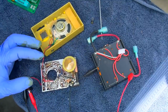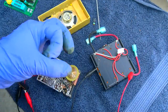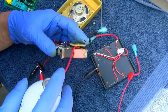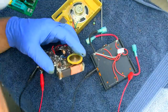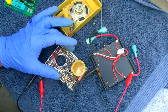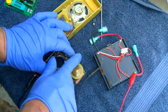I'm going to just sit here and scratch it for a few minutes and see if it wakes up. What I did was take some of this — which I probably shouldn't have done — and I'm assuming the ring on the tuning capacitor shaft that connects to ground is what's not making good contact. So I just put this up under here and sprayed it on the shaft, just a little tiny squirt right on the shaft. I'm assuming this is silicone oil stuff; it'll work its way down in there. I just don't want to get those plates jacked up. It seems to be helping.